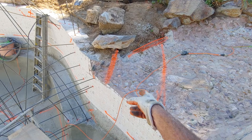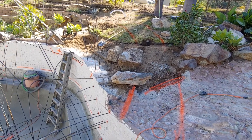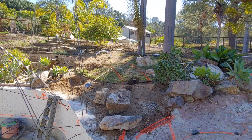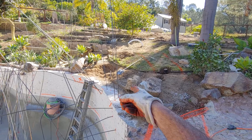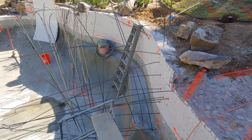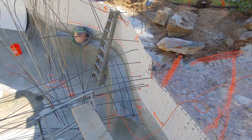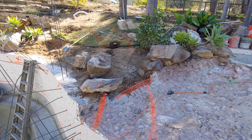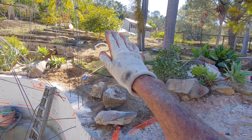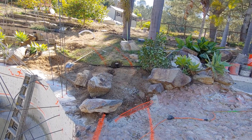Here's the slide — you can see where we're aiming. It's gonna have a nice big curve as opposed to a straight shot and then a curve, which is a little surprising for the rider. We want a nice even pathway for the rider. Up in the top areas, we have all the rebar stubbed out — it's not epoxied in yet, but we lay in the pieces to make sure we have enough. When we're ready, we pull them out, put the epoxy in, and put the rebar back into the concrete. We're gonna have steps and stairs around the starting area to carry people up to a platform and starting point, which will drop down and then level off with the nice even pitch of the slope.